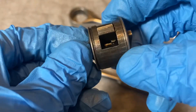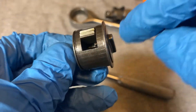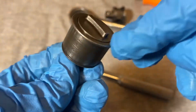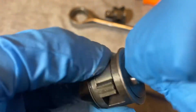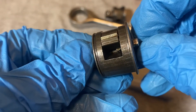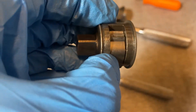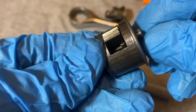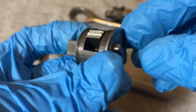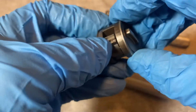Also remember that the plunger hole is drilled all the way through on these switches — the hole goes all the way to the bottom and the spring sticks out underneath. I can feel the spring on the bottom scraping when I switch it. That's one thing to watch out for — I wouldn't press this down and spin it all the way because the spring is going to pop out that end and could get stuck on the other side. So just have to be careful. When you put it in, you have to compress both the spring on the bottom and the plunger on top.